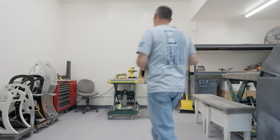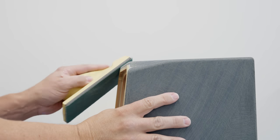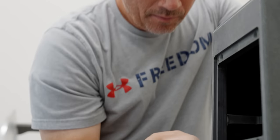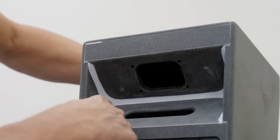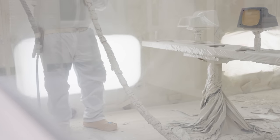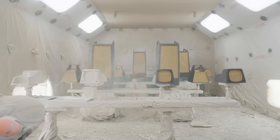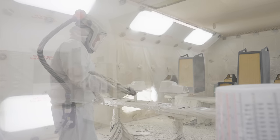Once Trevin has completed the fabrication process in the fab shop, it's moved to another QC station. Throughout the manufacturing process a run number is assigned, and Joe does some basic sanding to ensure that roundovers and all inspection points have been covered and there's consistency from one craftsperson to another. After this QC inspection, it's ready to be gel-coated. Gel coat is a marine-grade product that is impervious to water, and we use it as a prime coat in preparation for the speakers getting their top coats.